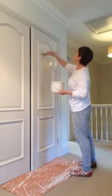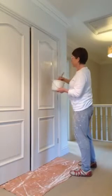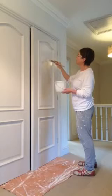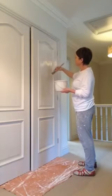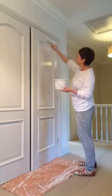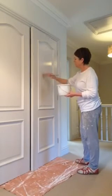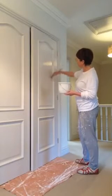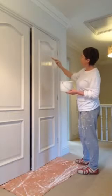Now I fill in the section. I'm doing what's called crosshatch - slapping it on in all directions and then just laying off to get rid of brush marks. Go into a dry area; don't join in where you've just finished off because all that does is put on too much paint. Go into a dry area, slap it all on for even coverage, then go from the area you've just done back into the previous one and lay off the brush marks. That was section one, this is section two, now section three - into the dry bit, slap it on, from this one back into the previous one. Section three into section two, lift out - like a little aeroplane taking off - so there's no brush marks.